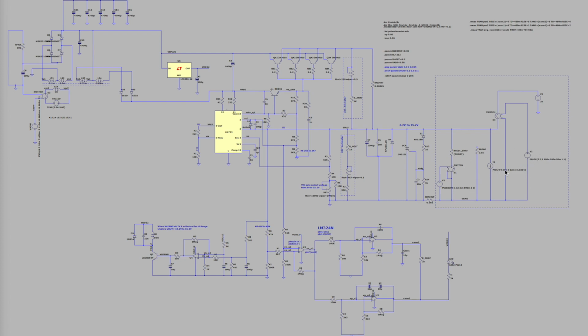Currently I have a current source load over here, which is set to a variable I load, which is going to be swept across many values. The bottom here is the upper cutoff, sorry, the upper annunciation, which if it goes above, I think, a certain voltage, it will create a buzzer sound as well as light up an LED. Then the under voltage detector here, it's got a longer time constant, and this is the range switching, which enables, through this transistor, a relay, which then changes the winding on the primary side. Of course I don't have that simulated, but it's just to show that it actually is doing something.